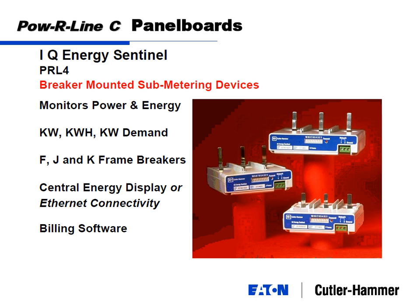But you know, everything nowadays there's a lot of LEED discussion, metering, monitoring. I need to get my energy use, I need my kW, my kWh. For LEED points especially, we are seeing a lot of cases where people want to monitor individual loads, tenant metering. Be aware that whether it's Powerline 4s or even switchboards, all manufacturers have devices that, for lack of a better word, we can snap right on the bottom if you want it on one of these circuit breakers. With those, you can see the ABC, and these basically sit right on top of that. Or you can take this and mount it in the side gutter. But that's going to measure your amperage, and it'll take your voltage input, and it'll output kW or kWh, most commonly to a building management system.